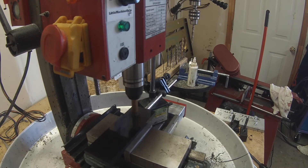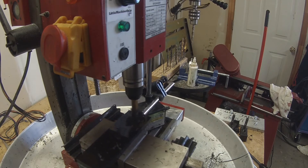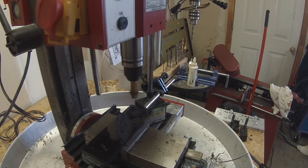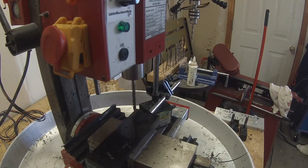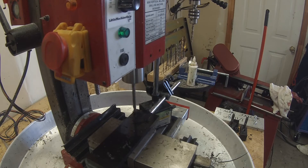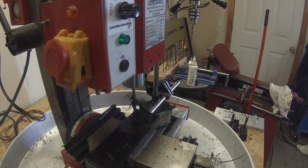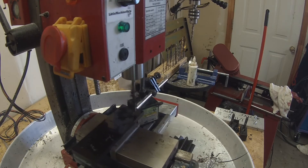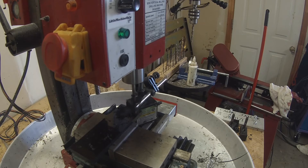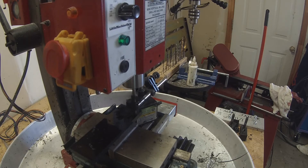Here's the half-inch end mill just milling that little flat spot I was showing you. A couple cool things here: the vise is obviously clamped to the table, that back jaw is not going to move. I've got my magnetic base there that is also not going to move, so every piece I put in there — as long as I line it up along that back jaw and up against that stop on the magnetic base — I don't have to do any touching off. Then here comes the quarter-inch drill bit, and those will just be used for alignment holes for the next step when I flip the part over.